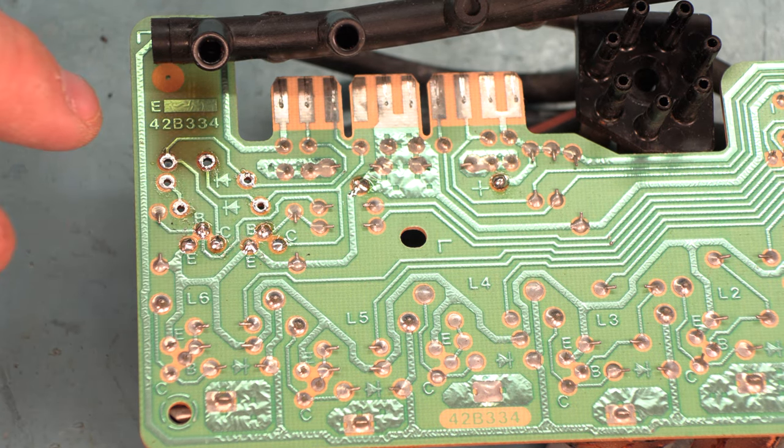Next we're going to re-solder the solenoids. It's fairly common for these solder joints to turn cold, and when they do we lose electrical contact — and in this case we also lose mechanical fastening, since the third solder joint on the back side is used to mount the solenoid to the circuit board. Something that makes this easier is liquid flux — it's not necessary, but it will make the job much easier. This particular programmer only has five solenoids, though there is a space for a sixth. We'll put flux on the mounting tabs and reflow those solder joints. We're going to heat the solder, feed in a very small amount of fresh solder, and remove the heat.